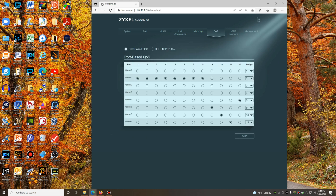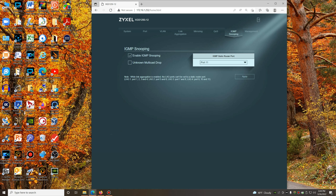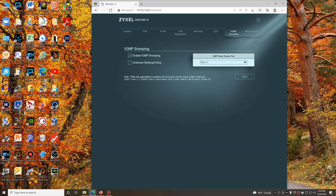I originally set the quality of service on the various ports — this is the same configuration. I didn't really alter it, with the 10-gig ports at the high end getting priority in terms of how much traffic they're going to be allowed. I also set the IGMP so that it will identify the main port connecting this switch up to the main hub switch. And of course you have the management screen where you can change your password and enable other features if you so desire.